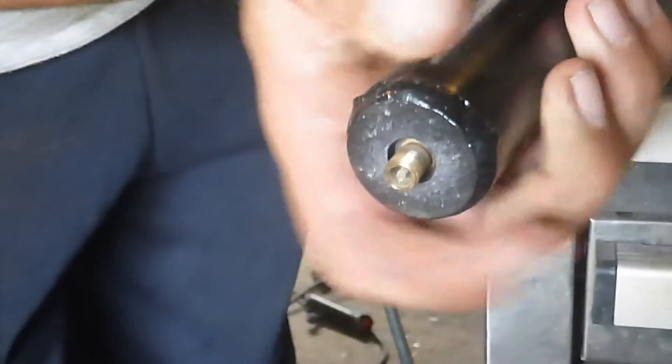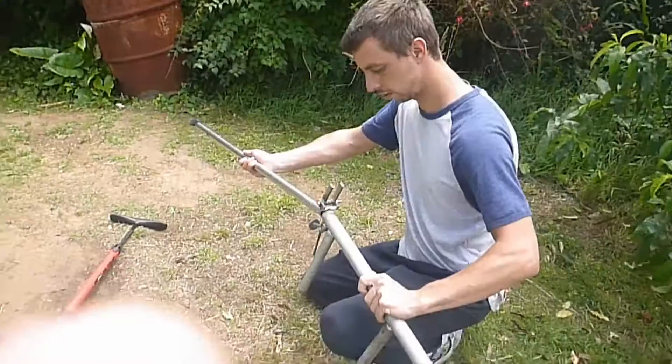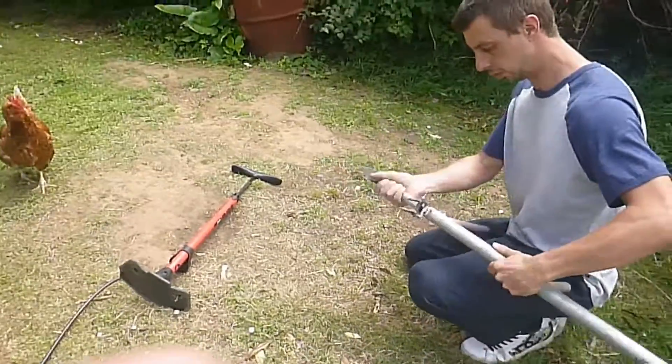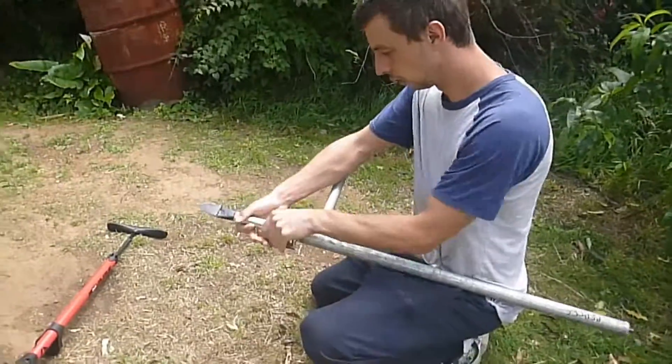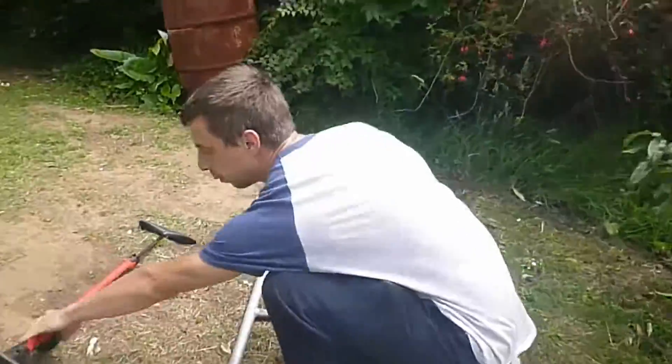So the arrow's got something to rest against. Then I just put the plug in the end and feed the arrow in so the valve stem goes through the hole, and then that can just stay in there. Once the arrow fires off, it just stays in there. When you want to load it up, you just slide it in — it slides over the plug in the back. Hook up the trigger mechanism and then you can just pump this up as much as you want.